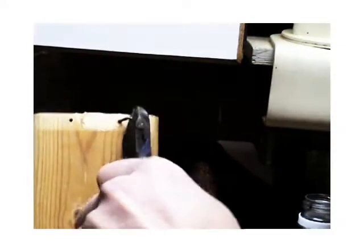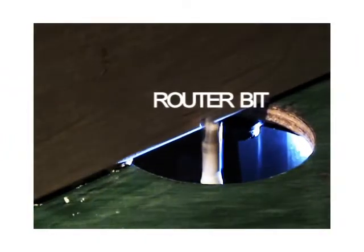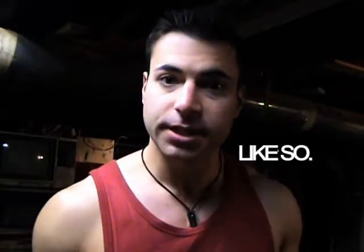One point I must stress about reusing wood from materials: you've got to make sure all the nails and screws and anything that's metal — just take them out — because you don't want to be cutting your wood with a table saw or your router. You can mess up the blade or the bit. So I'll just use some pliers and squeeze them out like so.